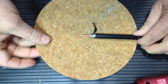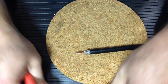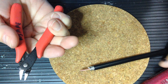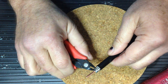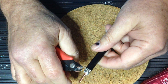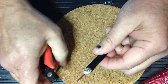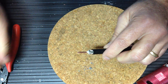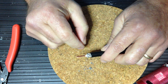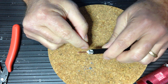And clean our work surface. The next step is to take our diagonal braid trimmers and trim back a little bit of the braid from the dielectric. This will help prevent a common assembly problem where the shield braid becomes unraveled during assembly and some of the conductors get into the dielectric area and cause a short.